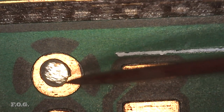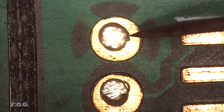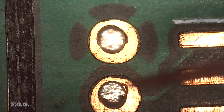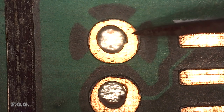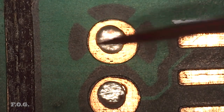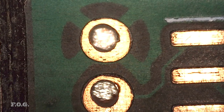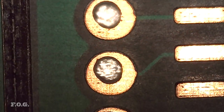So it looks like the basic position of the hole is probably meant to be here, which would be correct, or pretty correct. And all of this is just the wallowing. So I suspect that the mill bit is actually looking a bit blunt, because the original versions of this board didn't have this degree of wallowing. And with the combined very fast Z-axis feed speed, it's sort of slamming here and then bouncing around and then sort of getting back into position. So anyway, it's not a great test because of the environment, but I think there's enough evidence here to prove that the sensor is doing its job and it's actually getting the alignment pretty right.